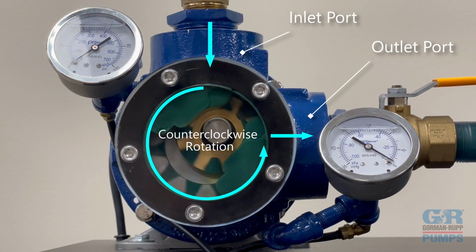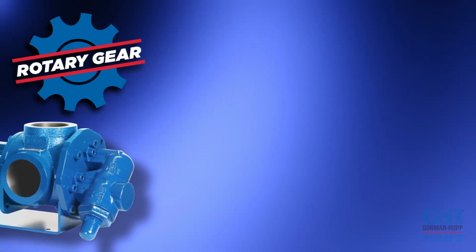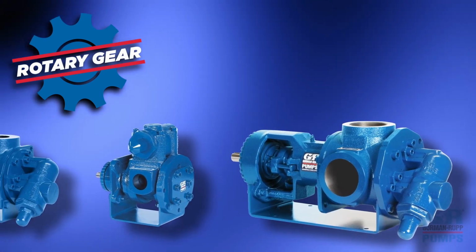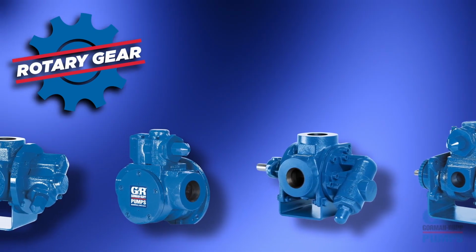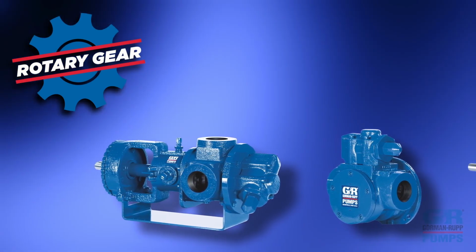equal efficiency. The precision machining tolerances and superior materials of construction allow the Gorman-Rupp G-Series line of rotary gear pumps to operate at pressures up to 300 psi, handle a wide range of viscosities without material upgrades, all while providing lower net positive inlet pressure required, or NPIPR, at unparalleled performance efficiencies.